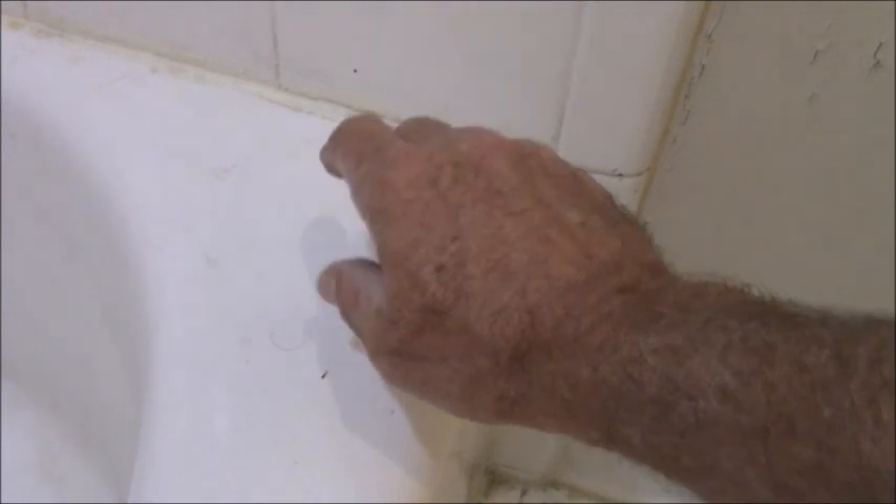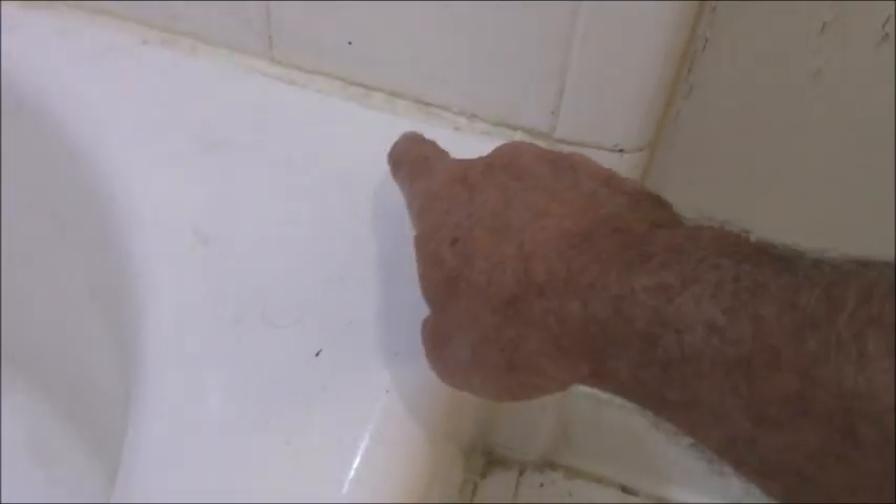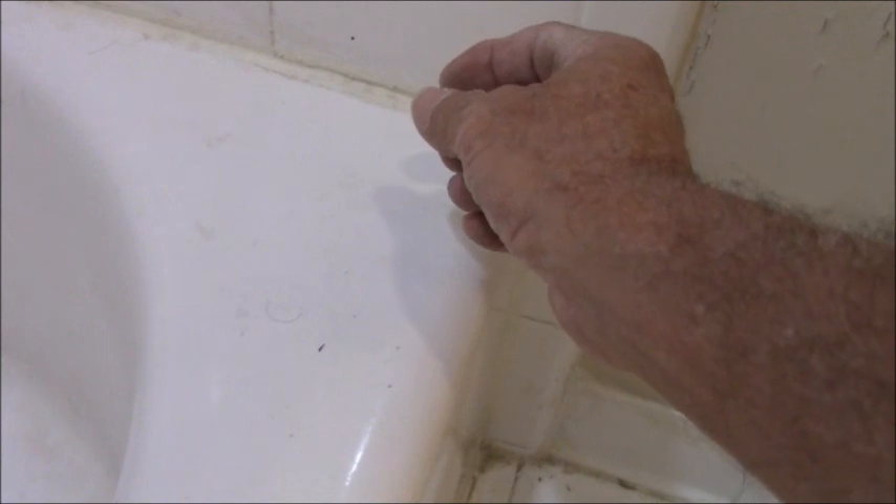The lip goes up like this, and once we take that away you'll see — at the very top of the lip is where people should set their wallboard. The tile should overlap that, so that there's literally a gap, with that little lip going down there, and there's nothing behind it.